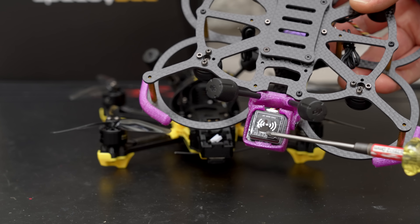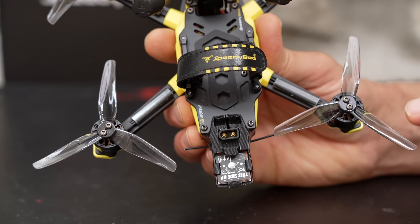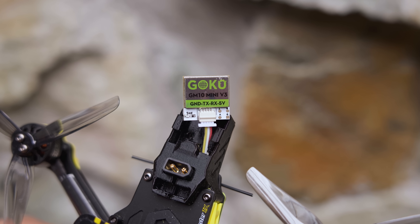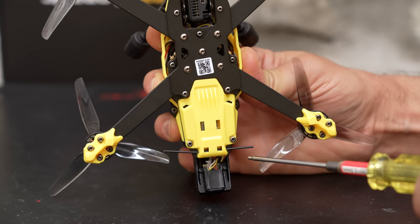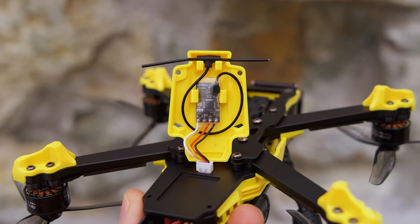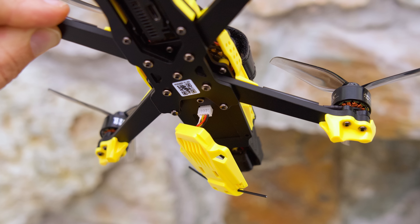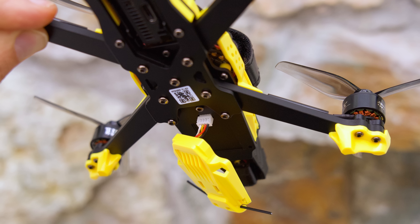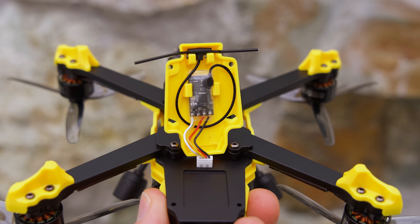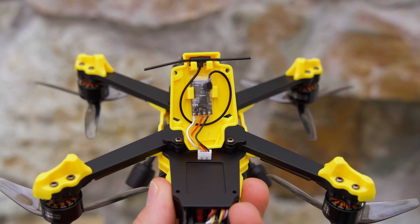I had a GEPRC GPS unit I wanted to use but it has a different pin out, so I ended up using it on a different quad. The ELRS antenna is mounted underneath and the receiver itself is tucked away and protected under a plastic plate, wrapped in heat shrink to lock down that UFL connector. It's connected to the all-in-one board with an extension that runs through the frame, making it easy to swap out if needed. If you fly ELRS, definitely get the ELRS receiver pre-installed — it's only $10 more and the installation is very well done, so you might as well get some free labor.